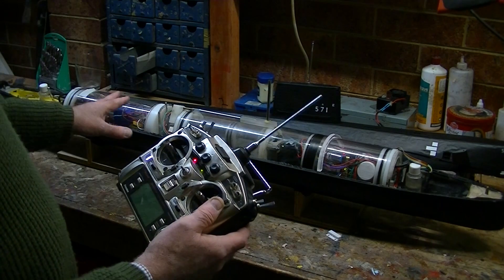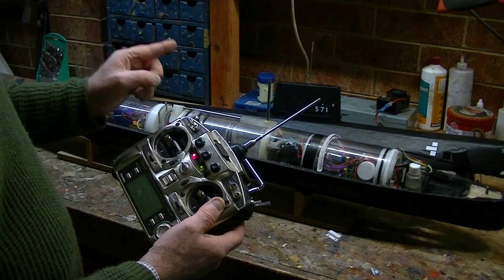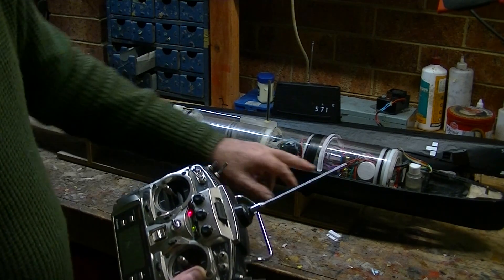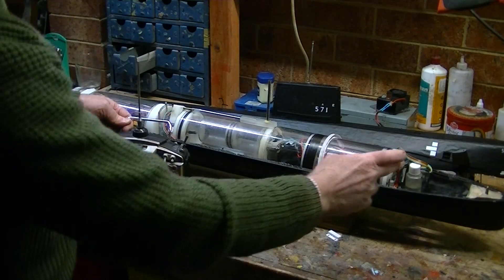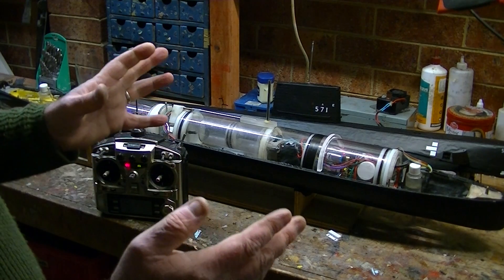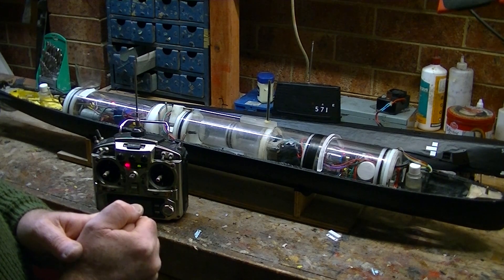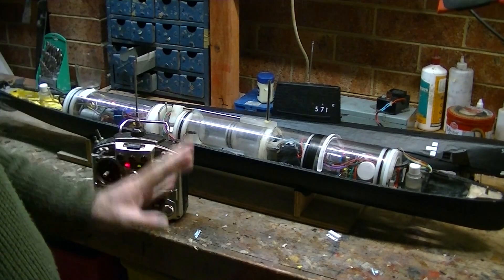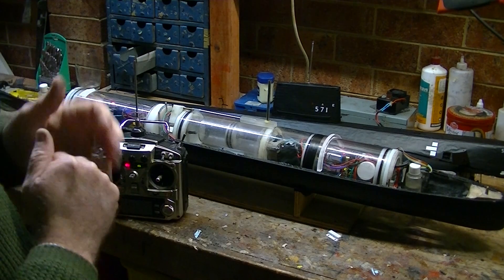I could do that without Arduino, but Arduino makes some functions work which are exceptionally nice. What I've added to the boat — in this little container here — is a pressure gauge. The pressure gauge sits out there in the water and constantly measures what the pressure of the water is. I can use that to automate depth-keeping control: it will control the bow hydroplanes and the piston to keep the boat at a particular depth. But let's go and have a look at it in action.